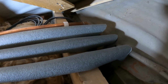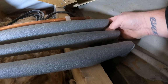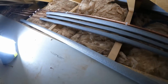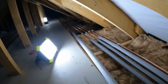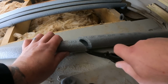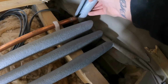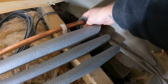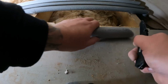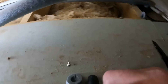He says as that one drops down, let's see if I've got it. It's just a case of cutting the end to a nice little 45 and then just slide it down and it'll just finish nice and neat on the pipework. So we get the rest of these done and work our way down to where the 15mm is. So I just do a little cut like that, pop that on like so, and then cut that off at the other angle. And it just slides on.